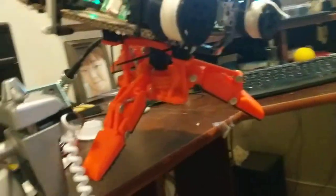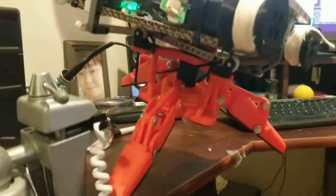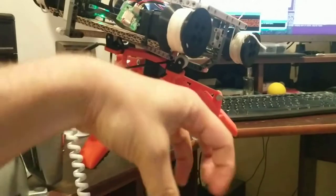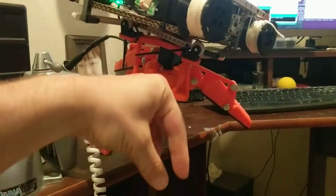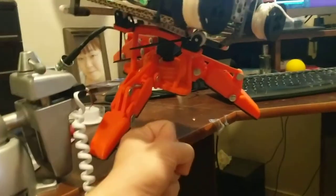I've got some new code on here that can control the gripper. I'm going to send it open and close commands, and it will try to go fully open or fully closed and stop when current draw exceeds some amount that would indicate that it has a firm grip on something.